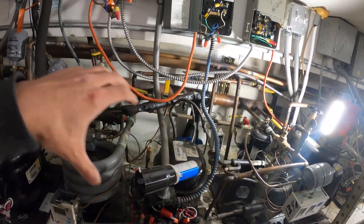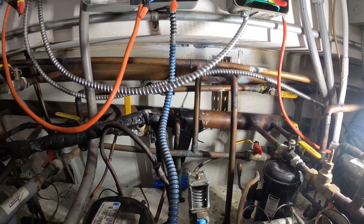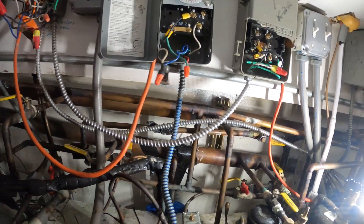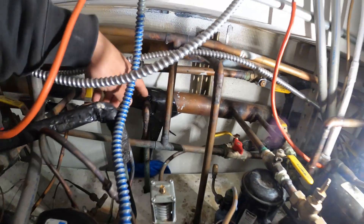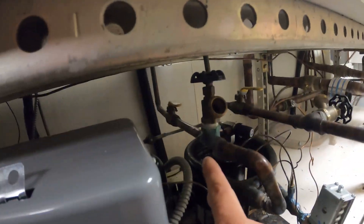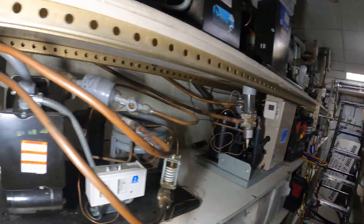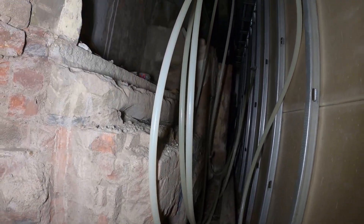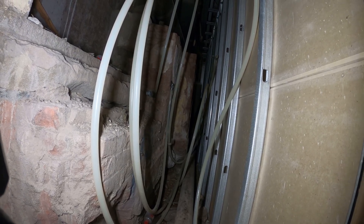It's going to be a really tricky one — there's so many things in the way. What I'm going to actually try to do is make a hole from behind the wall and try to make that repair. What makes this extremely hard is that it's not just a straight piece of pipe — you can see that it tees off right here and feeds this condensing unit. We do have access from behind, but the problem is we've got that piece in the way, so we have such a tiny space. This is going to be extremely difficult and dirty.